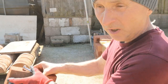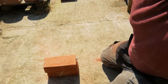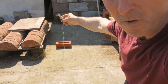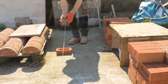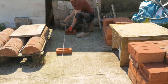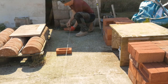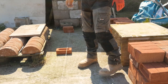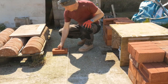I'm going to wrap my line around a brick, put another one on top just to weight it down like so, and pull my line out to the other end, making sure I'm two foot away from my materials. Just make sure your bricks are both further back than where your wall is going to be, so you don't have to move them again. That will do - this is where my wall is going to go.